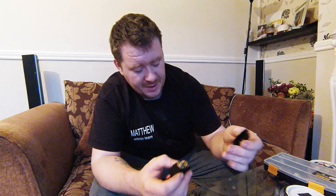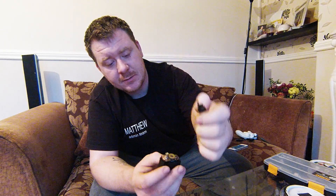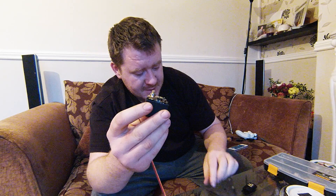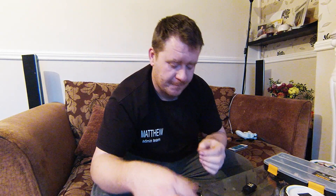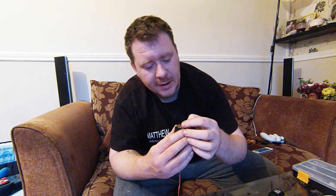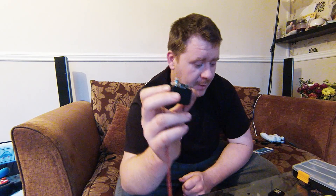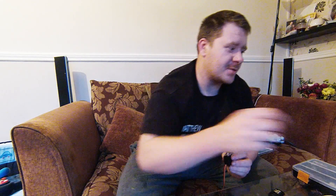The bearing will probably be in the top. What you need to do is get a little tiny o-ring — just like that — it doesn't need to be anything massive, just a nice small o-ring. Place it around the top of the servo. What that'll do is stop water getting in from the top. Before you close it up, you also need to chuck a bit of grease in as well.